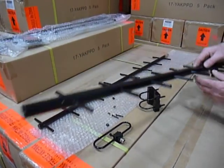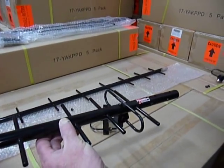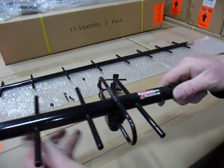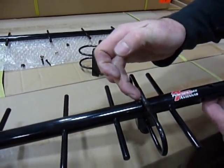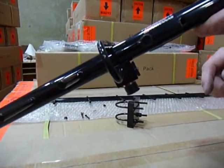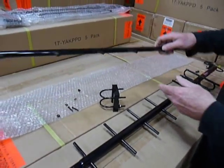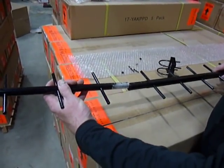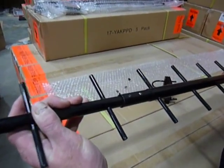To speed up the process, this is how it comes packaged. You just slide it over the back. How this gets mounted is that there's a screw on the front facing the front of the Yagi, and on the back you'll notice there's a nut. If you have it in this position you're okay. These two pieces fit together in a way that if the holes don't line up properly, you've got it upside down.